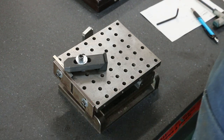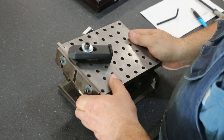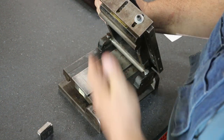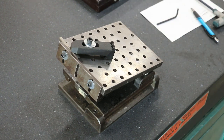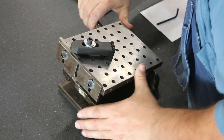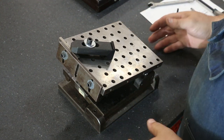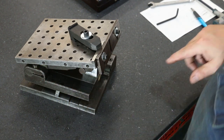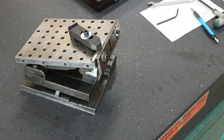Many sine plates have straps on the side — you tighten these down and it won't move. Now for the fifteen-degree back angle: this will be the top of the cutter, so the angle goes in the other direction. I clean both surfaces, place my 1.2941-inch stack underneath, let it come down, and use a wrench to tighten the hinges. Now the compound sine plate is set up with both a five-degree and a fifteen-degree angle simultaneously. I'll leave the blocks in and take this to the surface grinder.